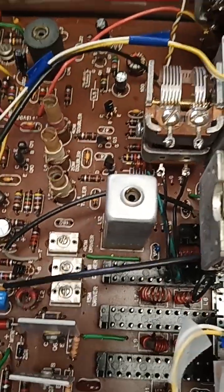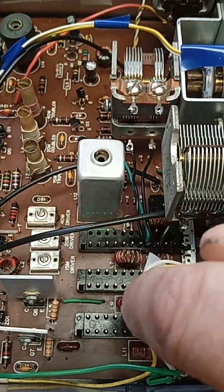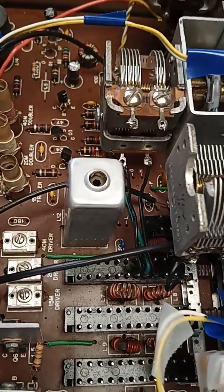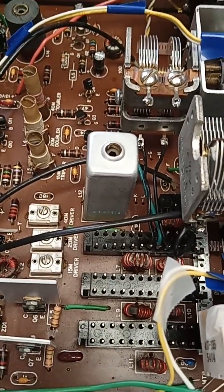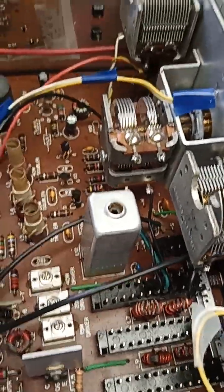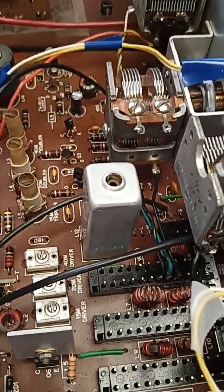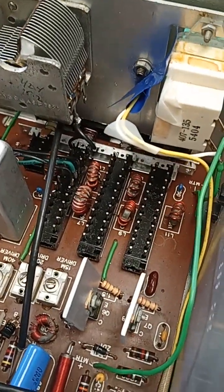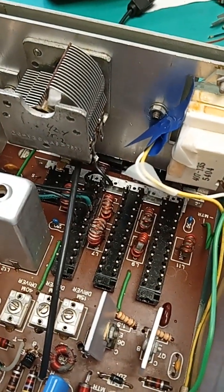This thing was an absolute terror to figure out how to get apart and clean these switches inside, because they're blocked in with that steel rail in the front. You can't pull the stems out to clean and re-lubricate, and a thing like that will have dried out grease and metal fragments inside — and that's very bad. There's no way without damaging this board, and these old brown boards are very easy to damage. The foil peels off real easy. It's a Bakelite or some kind of board — hard and smooth, so the foil doesn't stick to it as well as rough fiberglass.